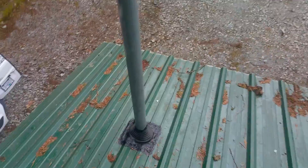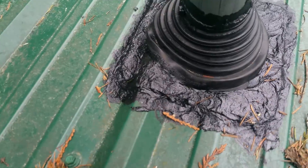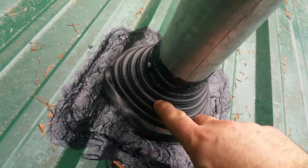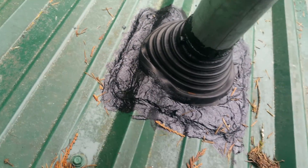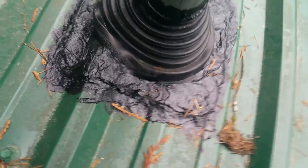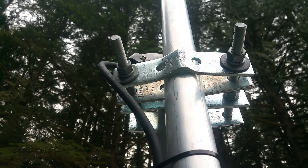Let's go on the roof. This is the first antenna I installed, so I'll continue with this one. I installed the flashing — you can get it from Home Depot. I used silicone as flexible insulation inside, and a roof caulking material — a roof repair patch from Home Depot — underneath and on top. I have some small screws to hold it in place. This is a Sinclair UHF antenna.